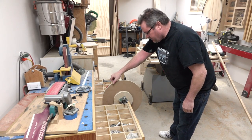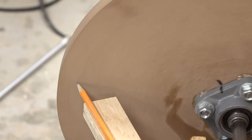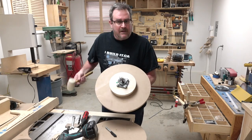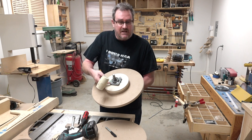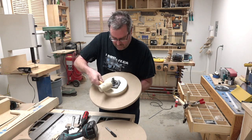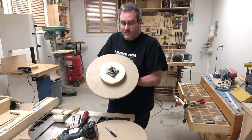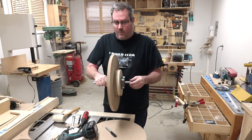Once again I've got my rig set up so that I can check the wobble. I've also got my stick with the pencil on it to mark where it needs to be adjusted. Now all I need to do is adjust the bearing on the other side. I've got these studs put in — they're tight but not too tight — so I can move this just by tapping on it, and that should with the right number of adjustments make this run without any wobble.